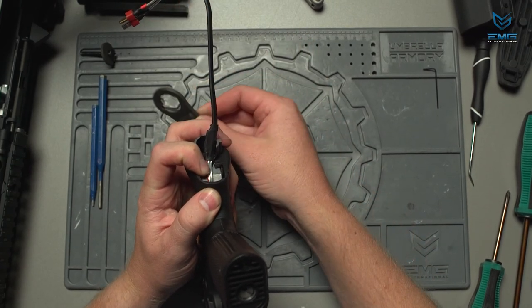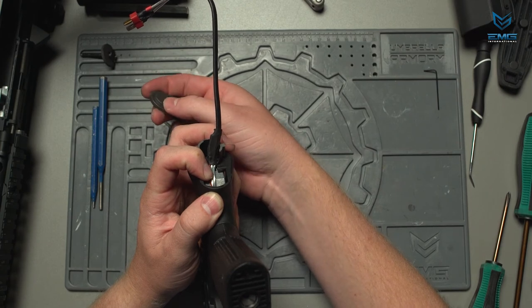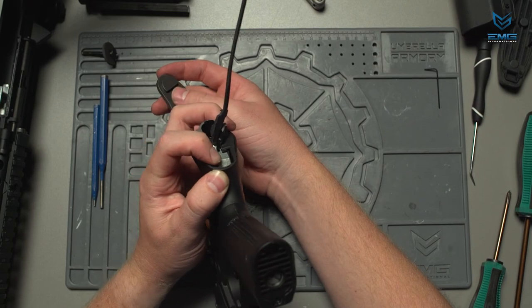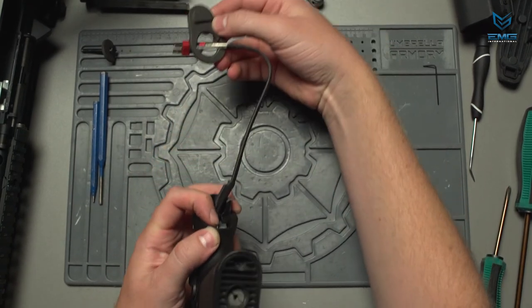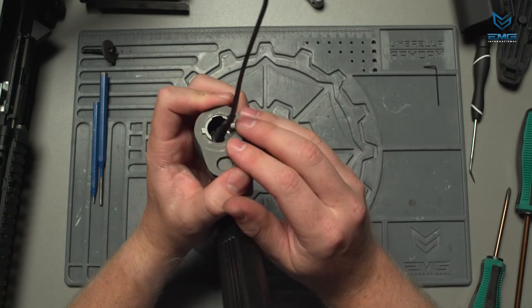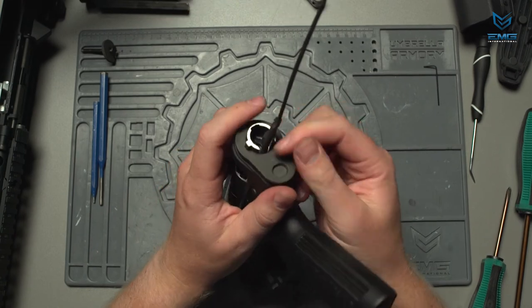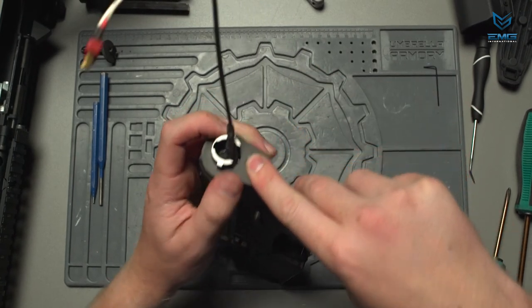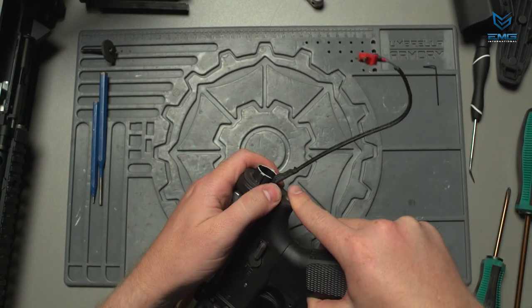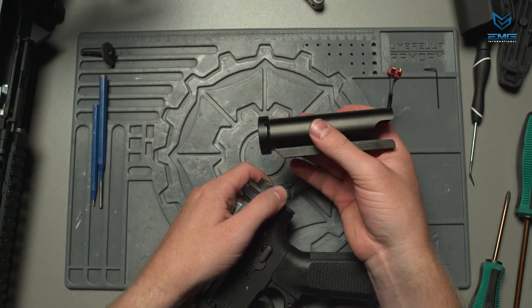So we're gonna take our spacer, and the part that has the raised portion is going to notch into the back of the receiver here. So feed that over the wires, down and over the end of that lower receiver. There we go. And just make sure that your wires are sitting pretty and not getting pinched. Awesome. And now, take your buffer tube